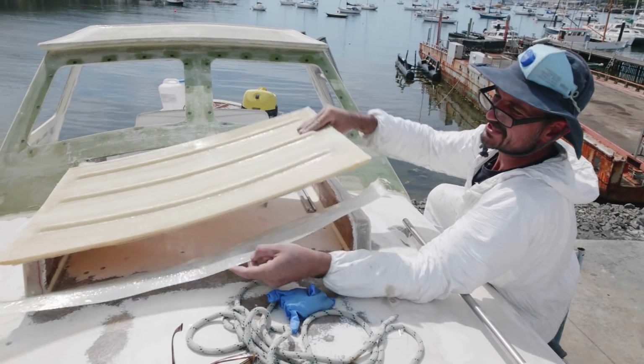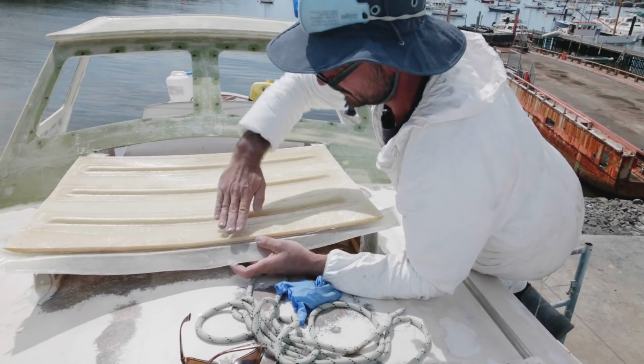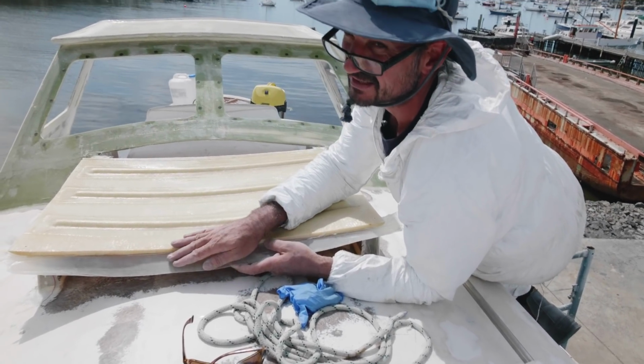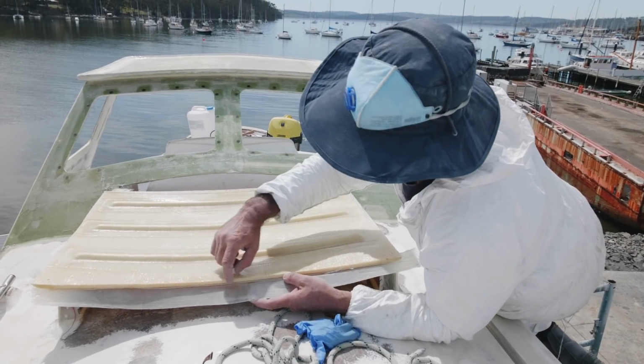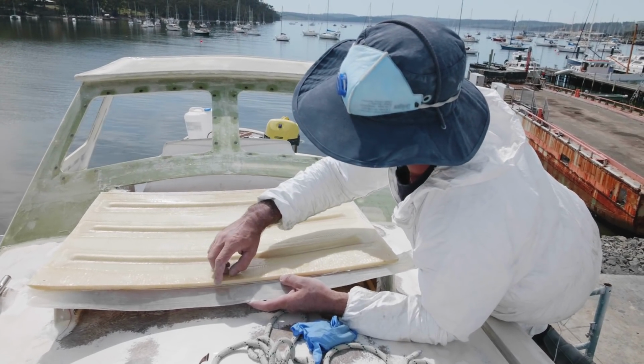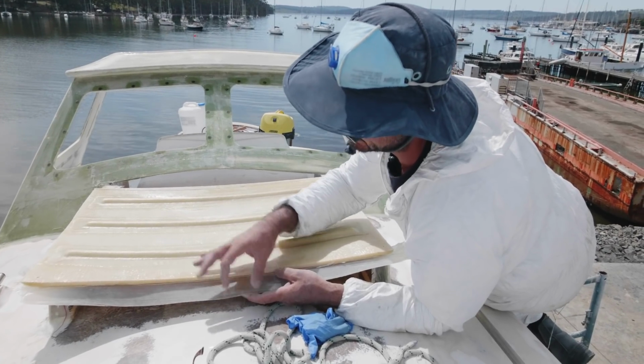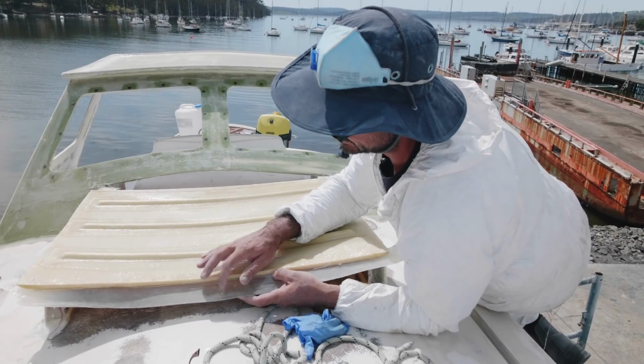and then on this underside we'll fair that off and we'll run a bit of glass over to join to that, and then we'll have a nice, well, this foam, this would be a weak edge otherwise, but because we've got two bits of glass joining together and making a nice thick lip, that should work pretty well.